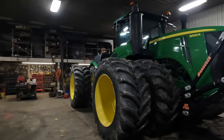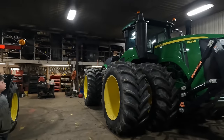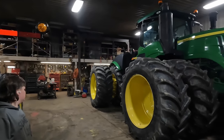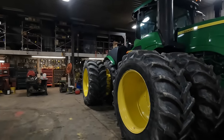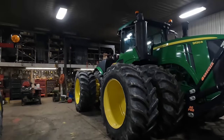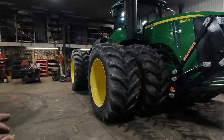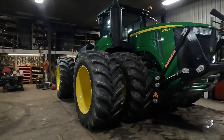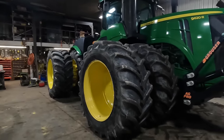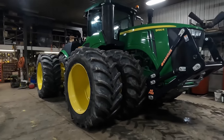And you can also run into the issue of you've got to be moving fast enough. If you're moving down around 2-3 miles an hour and that's all the power you have and you're tractioned up and you're not slipping your tires, you can hurt a differential. However, if you're spinning these tires fast, you're torquing on the differential because every once in a while, your traction will go from one tire to the other, splitting and going back and forth, and you could ruin a differential by gaining traction immediately once a tire is spun. So these tractors need to be weighted accordingly.